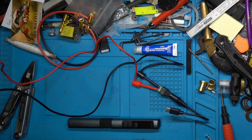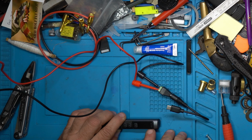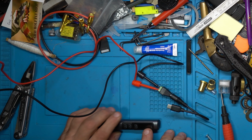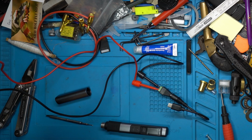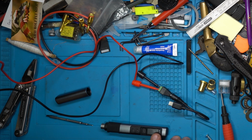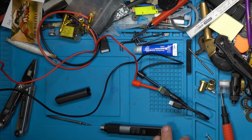Let me change, let's just go down to 2.5 amps. So I got it set at 2.5 amps now, and let's see how low we can go and still get this to fire up. Every time I watch the voltage on the screen, I don't think I saw it drop below 20 volts until this last time that I went to 2.65 amps. So let's see what it does when this cools down at 2.5 amps. What I want to try to do, because the iron did trip out and restart with this power supply, I think I had it set at 2 amps per channel, and I forgot and only turned one channel on, and it tripped out and started restarting. I think maybe we'll get down that low before we start tripping completely out. It seems like it's heating up a little slower because the voltage is dropping on the iron, so it's regulating itself down to a lower voltage.